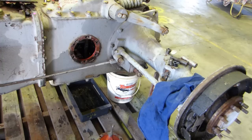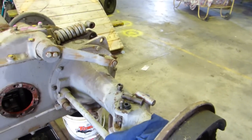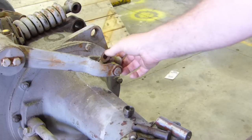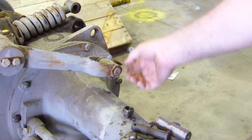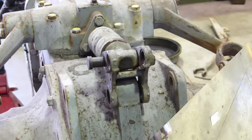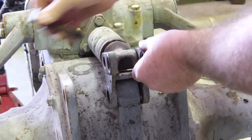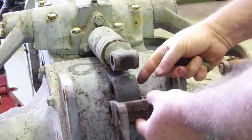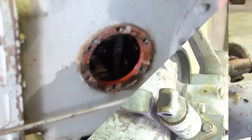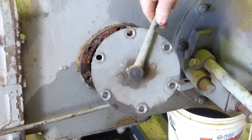Number two on the list - the top lift pins. You can either take this pin out or the pin that comes across there; you have to do that on both sides of the tractor. Number three on the list: remove the draft spring pin - that's this pin here that goes onto this spring. On mine I've taken the bush out already, but on yours it will probably stay there.